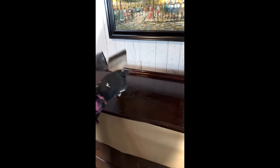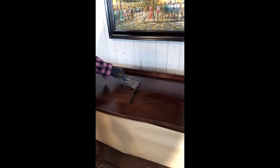So, and probably years and years of furniture polish, wax. I mean, before they had furniture polish, they used shellac. Layers and layers of shellac or wax. Wax has been around for a long time, like beeswax, so that would have been what they would have used. But what I want to get, I might not get this down to where it's perfect, but what I am wanting to get is to where my knife here slides easily. It's getting right underneath and right on top of the surface of the wood. So that is actually perfect.